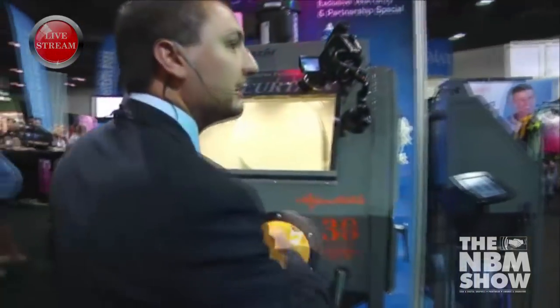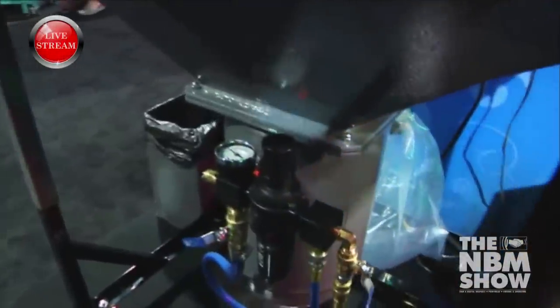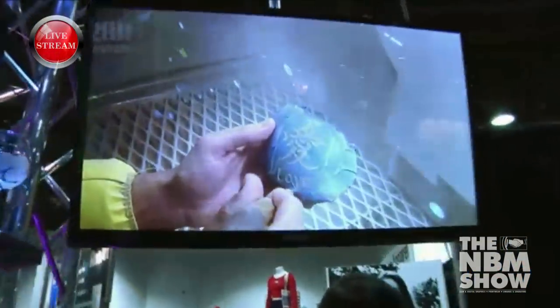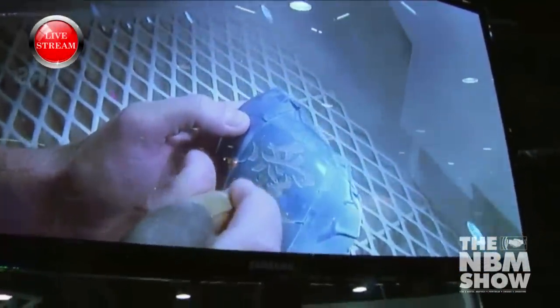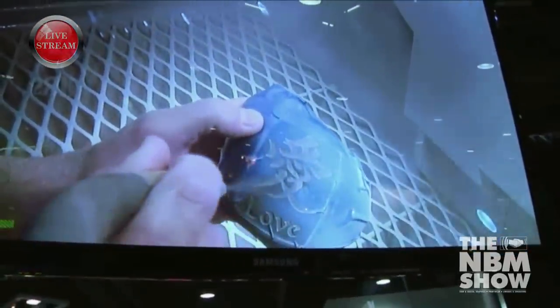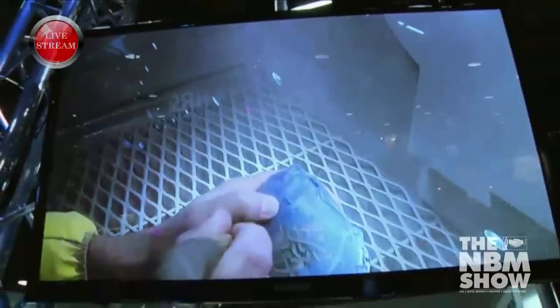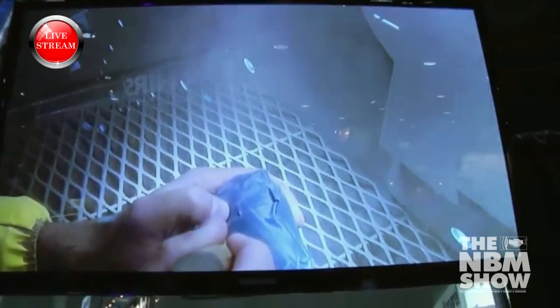We're using aluminum oxide, 150 grit, at about 40 pounds of pressure. I'm just going to step on my foot pedal, remove that membrane — you can see the membrane disappearing — and now we're etching. One thing I want you to notice is I'm not wearing any gloves inside the cabinet. The sand really isn't going to hurt you unless you hold it on your hand for several seconds. What you're actually feeling is the heat created by the friction of that sand — the same thing that deteriorates the mask. You can see the mask turning a dark color as it absorbs the heat from the sand and friction.